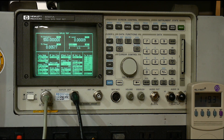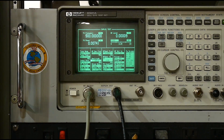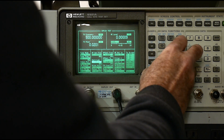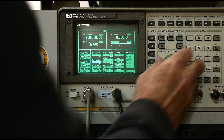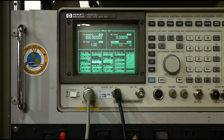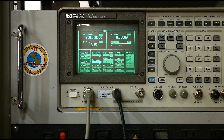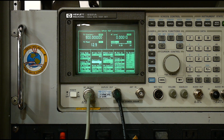There we go — so we're inputting. Coming out of here, going into the front connector, through that coax into the amplifier, and then out the coax into this connector here. We have a little bit of power, so we need to up the amplitude of the input. At zero dBm we're having about one watt come through the amplifier. Let's go up to plus five dBm — we'll now have coming up on four watts. Ten dBm: 12 watts. And 15 dBm: 15 watts.